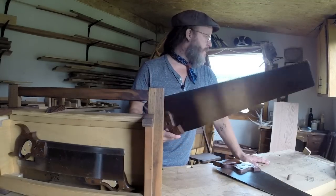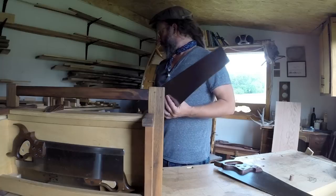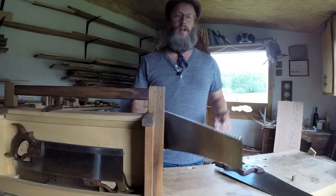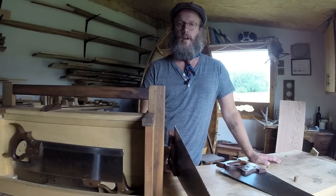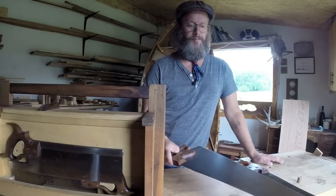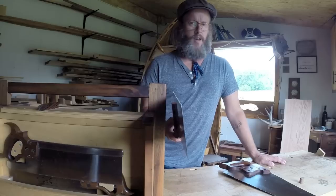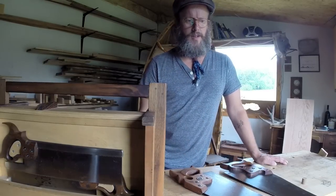For ripping the wood — which I didn't rip that plank — but I did rip some spruce, some birch, a bit of ash, and some walnut. So quite a variety already, but those were just little pieces I ripped since I've been here this summer. I did that with this 26-inch rip saw, 5 TPI, which is kind of an ideal size for a 26-inch saw.